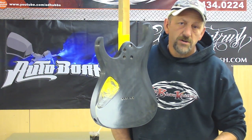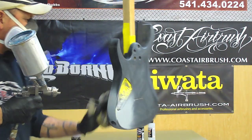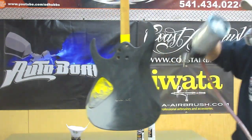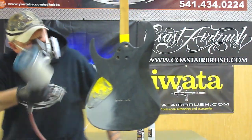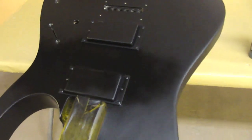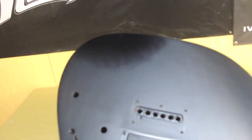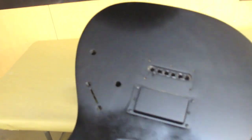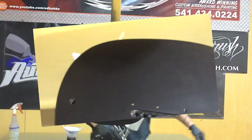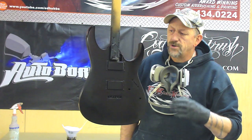I'm going to turn my exhaust fan on, turn my heat on, put my mask on, and get to spraying. As you can see right there — see how it's still wet? You want it to be a satin finish. You want that wetness to carry out all the way. It's been about five minutes. I've got it about 70 degrees in here, fans on it, heat on it, so I waited about five minutes in between coats and put three coats on.